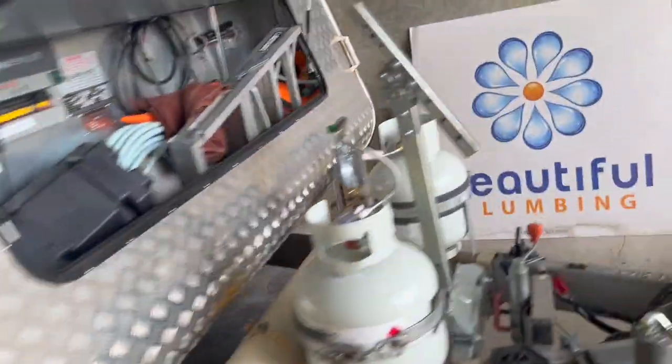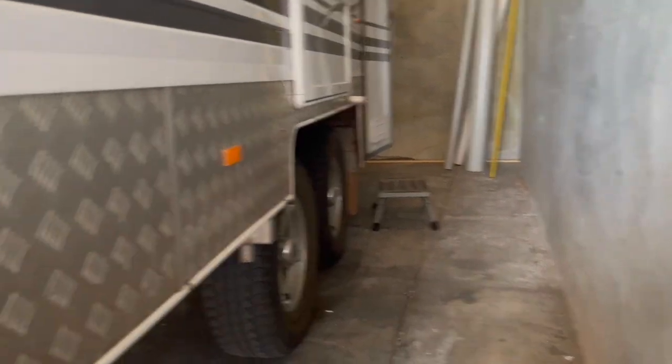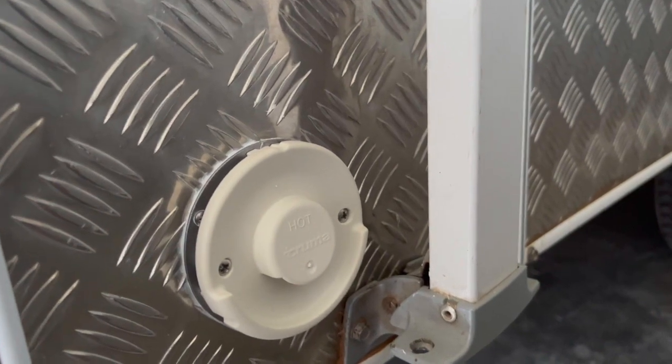The other trouble is underneath here — there's a power cable going straight up inside the cupboard where they've got two power points. So the pipe would have had a good chance of being right on that wire, so I thought no, that's not going to work. I went around the other side of the van and did some measurements. The vent could come out there, which is fine because there's no combustion materials. And here is the annex wall — obviously I couldn't have it blowing into the annex because someone could seal it off nice and tight and gas could build up. Some of the grandkids sleeping out there could pass out and never wake up. This was probably the only viable option, because with these Trumas you can't go through the floor — that would be great but you're not allowed to do that.